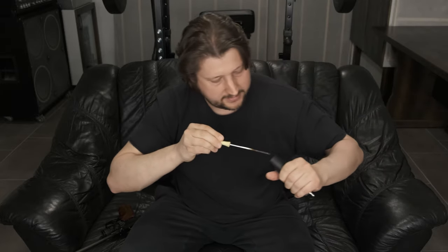So there is a lot of thread, and this thread has a really small step. It's a 1 millimeter thread. So first of all, as you can see, there is no O-ring here. That's because, of course, I have the regulator inside, and the regulator needs to be vented. So in here you can see the regulator. I will take it out now.